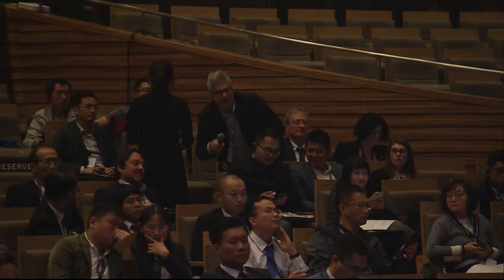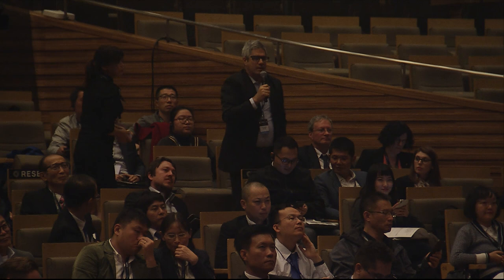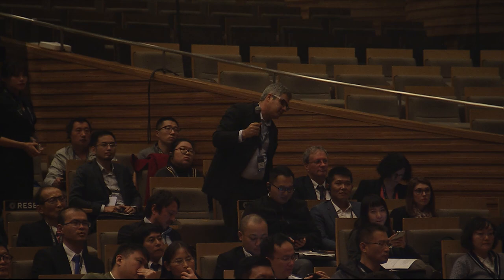Jonathan from Nemo Technologies. One question regarding the results here: are they based on injected bars or compressed bars? That's a good one. The mechanical properties were measured on injected parts, and the electrical conductivity on pressed parts. And the last one: have you tested it reinforced with glass fiber already, or is it the next stage? This would be the next stage, yes, to add some glass fiber.